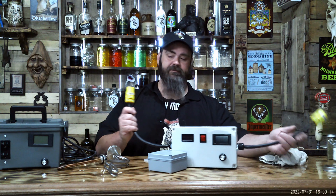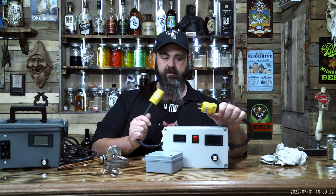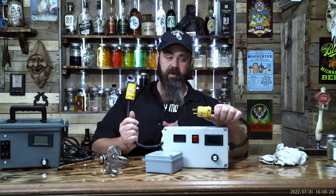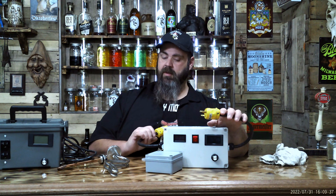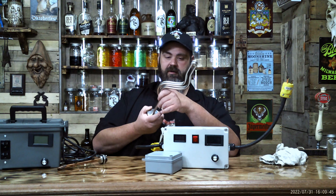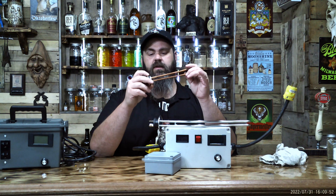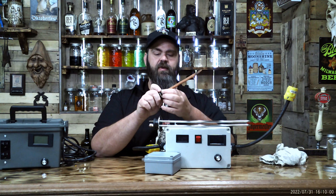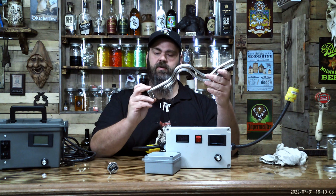It's really easy to use. If you're going to have a 240, you've got to have a 30-amp plug, a 240 plug. You could use your dryer outlet, but if that's inconvenient you could either wire yourself one up or pay an electrician. You plug this into your 240, run a plug from this, put this in your still — I'll show you how it looks and where it goes. You can also buy these cheap little copper 2,000-watt 120-volt elements, but my thing is you've got to have an adapter. I like going straight from a ferrule — just put a gasket over it, tri-clamp it to your still, and you're running with electricity.